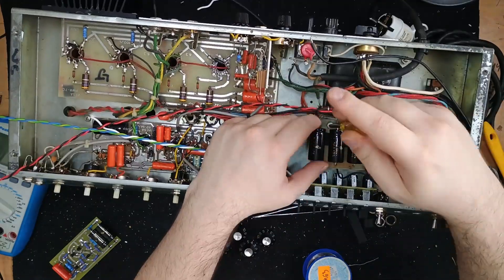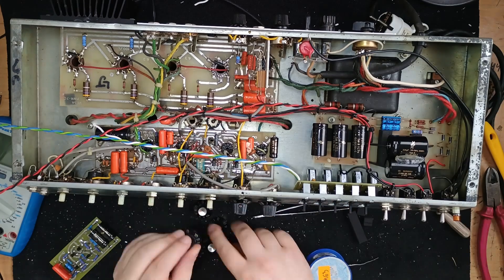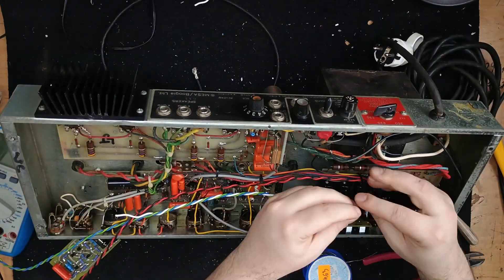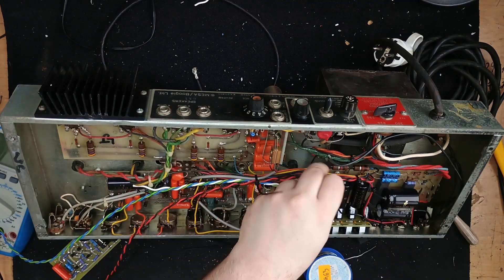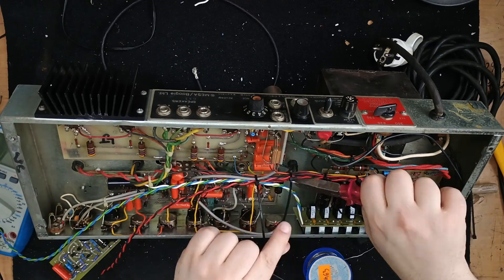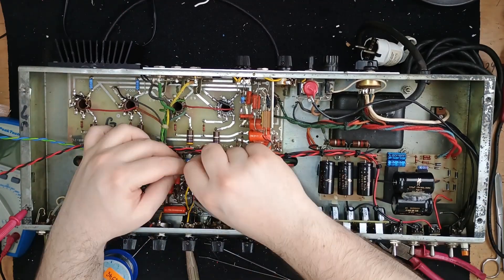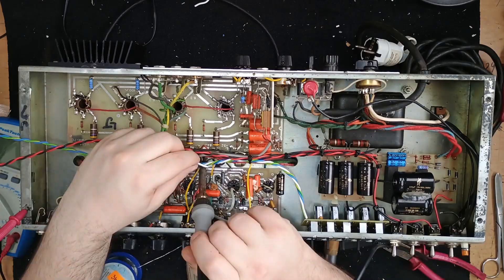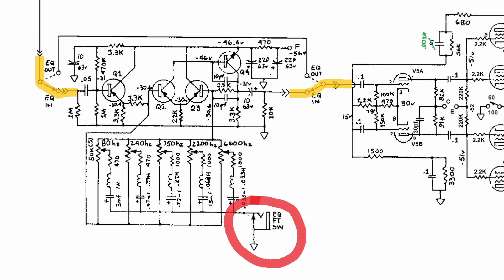The power supply board can be screwed back in, as I'll no longer need access to the underside. The color scheme I used for some wires is different from original, so even if the boards are made 100% like the original ones, it'll be visible that the amp is upgraded at a later point. The white wire goes to the TRS footswitch jack, which allows the GEQ to be controlled externally. If the switch on the front is in the off position, the signal goes directly from the preamp to the phase inverter in the power section. In the on position, the signal goes through the GEQ, but the footswitch can now be used to lift the sliders from ground, essentially disengaging them.